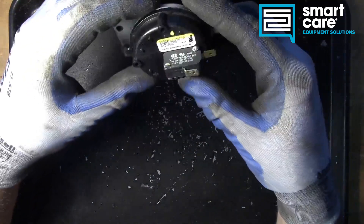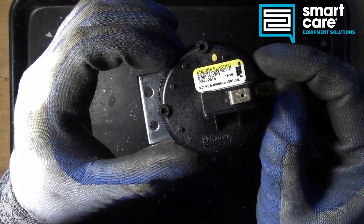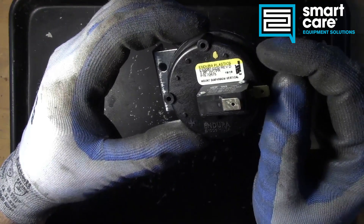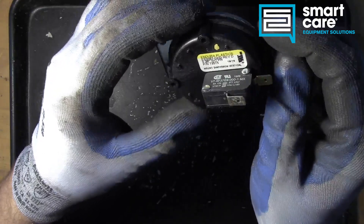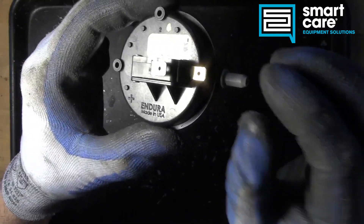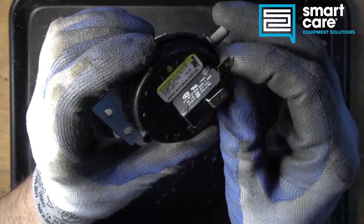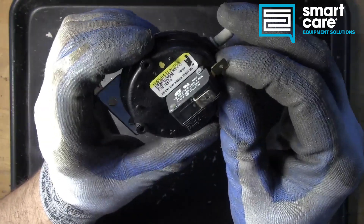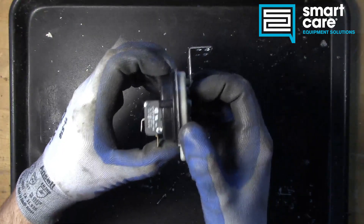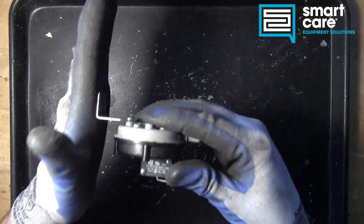Taking a look at the label, it has a couple of part numbers and a rating. The rating is very small — 0.26 inches water column — so it takes almost no suction force at all to actuate. Also noticeable on the label is the instruction to mount diaphragm vertically, meaning in correct installation it needs to be oriented so the diaphragm is vertical.